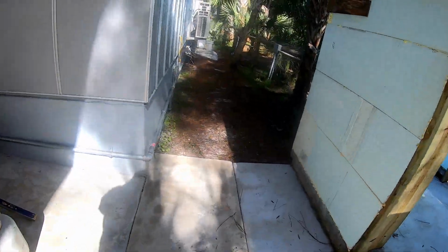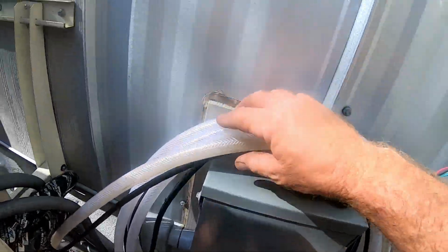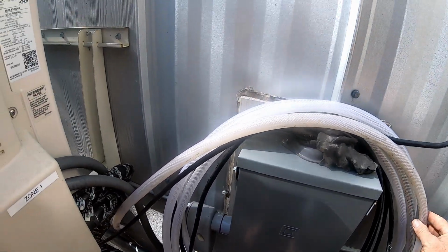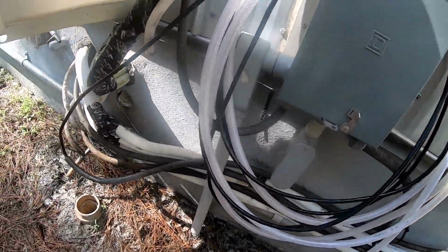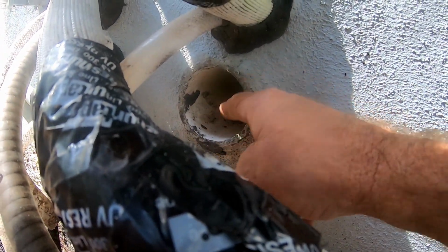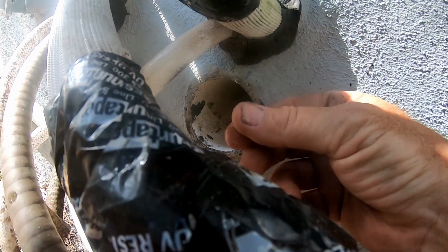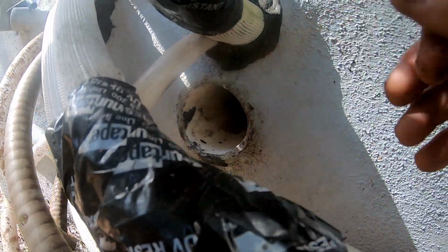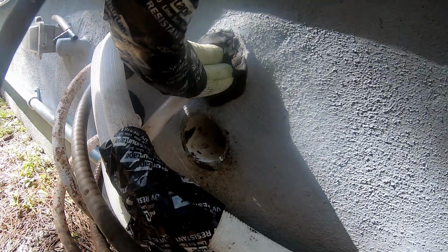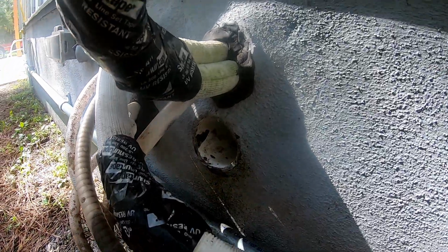Looking at everything else, this was all up inside there. It all looks fine. Ain't nothing wrong with it. You can see the sleeve. And the sleeve has some condensation inside of it, and you can feel a little bit of oil in that water. When I installed those pipes, even though they weren't plumbing, I also sloped them at 1/8 per foot, just like you would with normal 3-inch, so anything that did build up in there would just flow out.